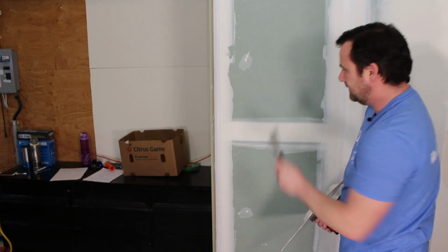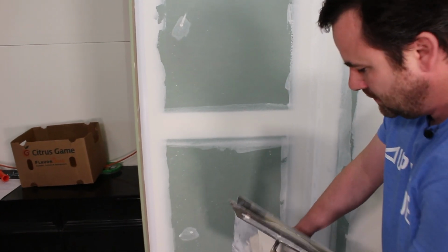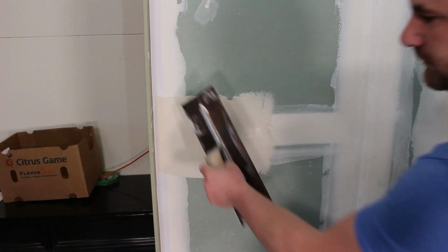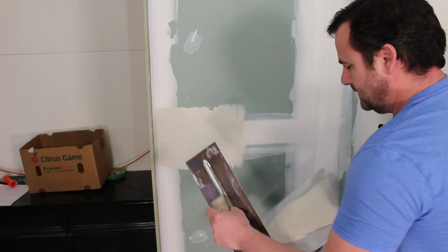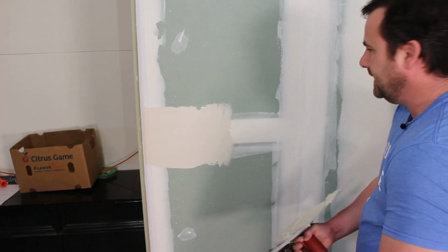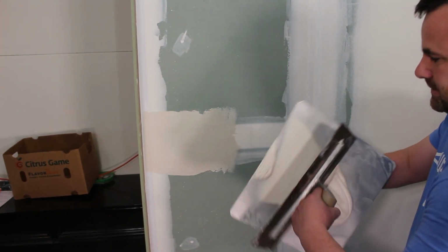I'll just scrape it out with the knife. Pretty easy. Now I can finish that. Don't want any hitchhikers. Okay. Now I don't have to ride right into the very corner, because when I wipe this tear away this way, it'll fill that. Because all we're doing is filling all the flats now, and that way when we do our beads, we come down in this direction, we're not going to come through and hollow out over top of those beveled areas of the flats.